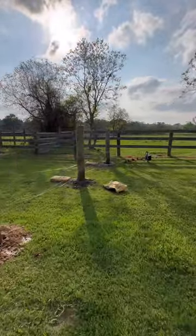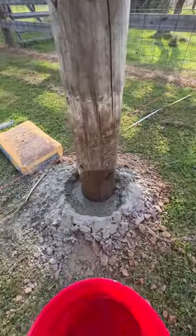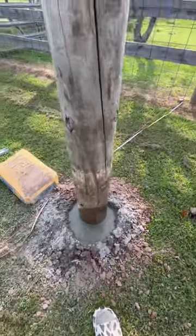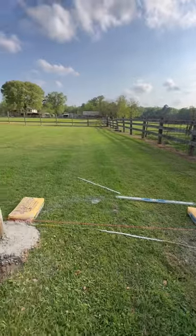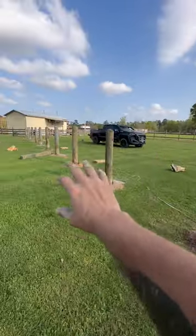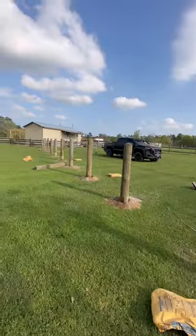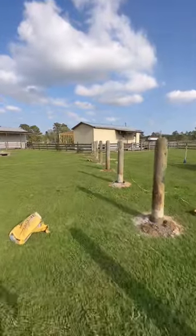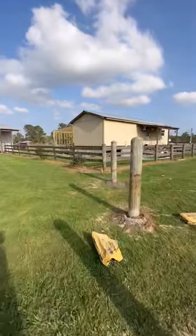I'm on the last post. I did them all the paw paw way, and honestly I did it the paw paw way for this fence because on this kind of fence you don't really have a lot of weight on it — no pulling or anything like you would with a barbed wire. On these, you're just going to have the cow panel stand up against it and staple in, and then you're going to have the corral boards — like these 16-foot corral boards — running all the way down. Alyssa said it looks straight, so I trust her and I know I'm not going to make a fool of myself when I turn and look at these posts.